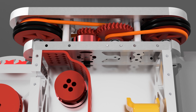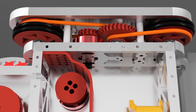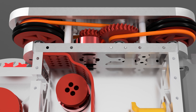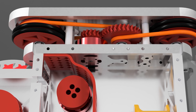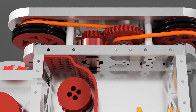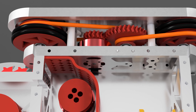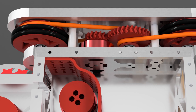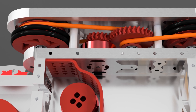Even though Drakonid was 12 pounds, keep in mind it needed to be tensioned quite a lot to reduce slip. This is basically down to the fact that you're relying entirely on friction when you use a V-belt, round belt, or flat belt, whereas with chains and timing belts you have toothed belts and sprockets into a chain, which positively locks the two together. So you're basically guaranteed to have torque transfer if you have anywhere close to appropriate tensioning, though you do get some efficiency losses if it's not properly tensioned.